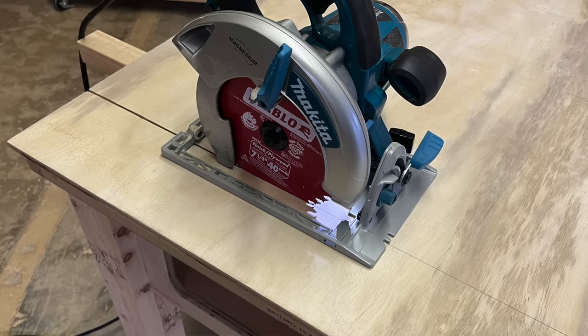To finish the cut, pass the full length of the blade all the way through the board until it's out, then lift the saw away before the sole plate falls off the edge. It's easy to jostle here, especially if you're reaching. I try to avoid that by driving forward until I'm all the way clear.